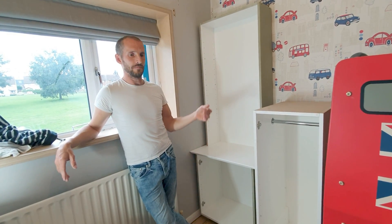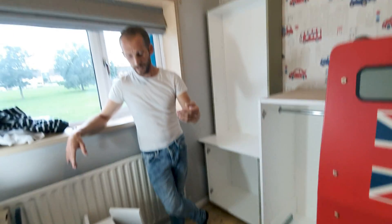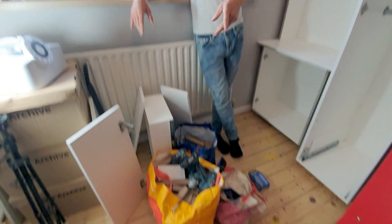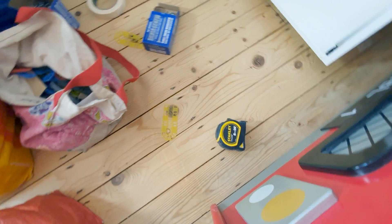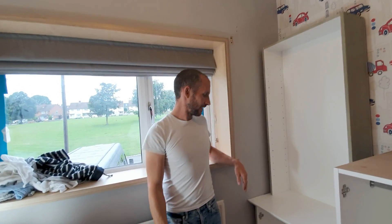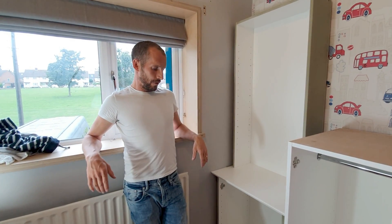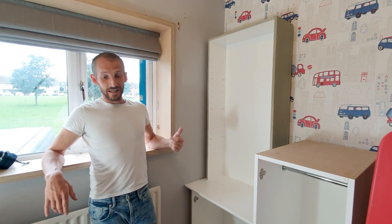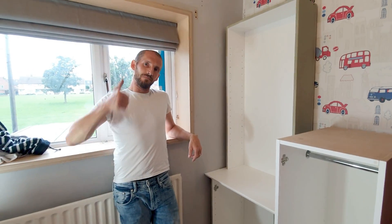That is how I do bearers for anything — whether it's an alcove unit, window seat, or anything fitted. All you need is a set of packers: 18 mils, 6 mils, some small shims, masking tape, 30s and 50s, a tape measure, and a drill. I'll crack on and finish this — get it fixed down, put the shelves in, the trims on, and the doors on. I hope you've learned something from it. If you've got any questions, fire them at me. If you're enjoying the content, hit the like button, subscribe, hit the bell button — it all helps. See you in the next one, ciao for now.